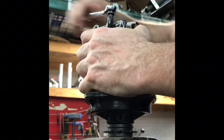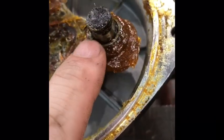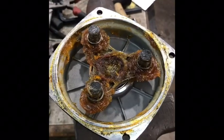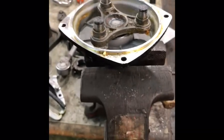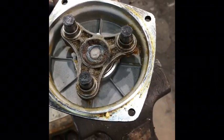So this is coming off now — and that's what the gear looks like. These are the original nylon gears removed. This is the planetary gear holder. Notice that there is a little ring here that is a spacer that needs to stay in place to keep the gears at the correct spacing. I'm going to remove as much of this grease as I can and start installing the steel gears in the opposite method, probably tapping them down with a hammer or mallet. I'm just getting the bulk of the grease out before putting in the steel gears.